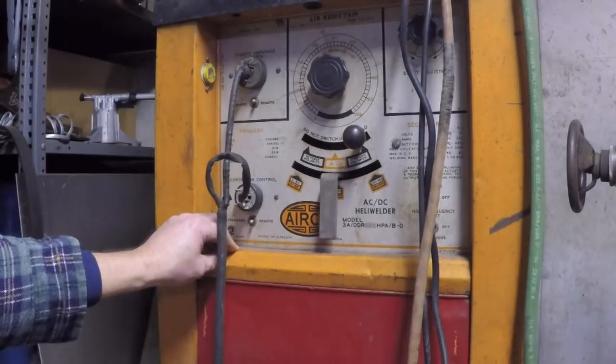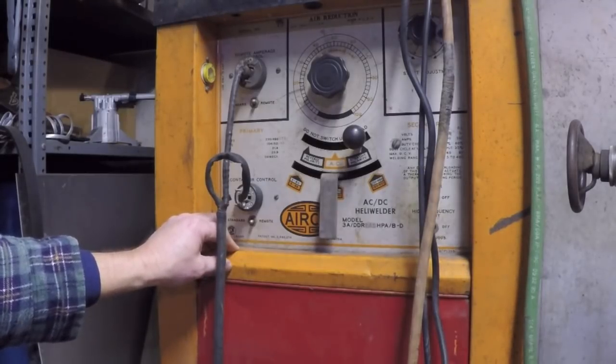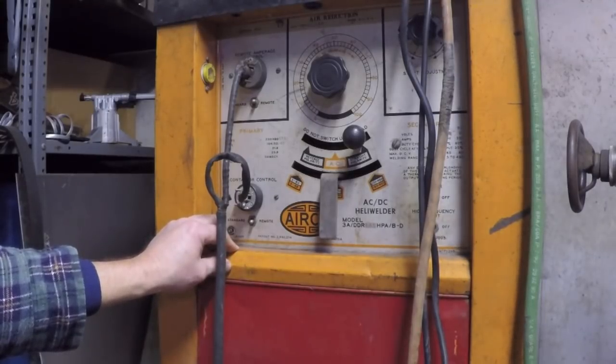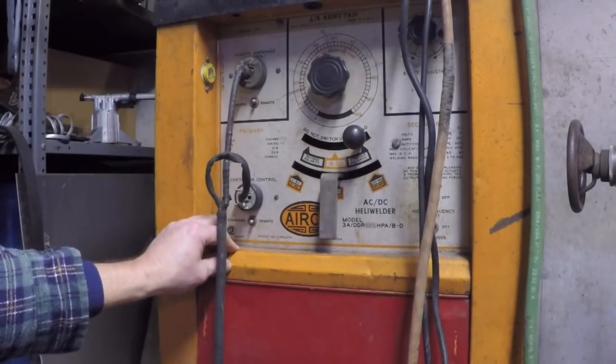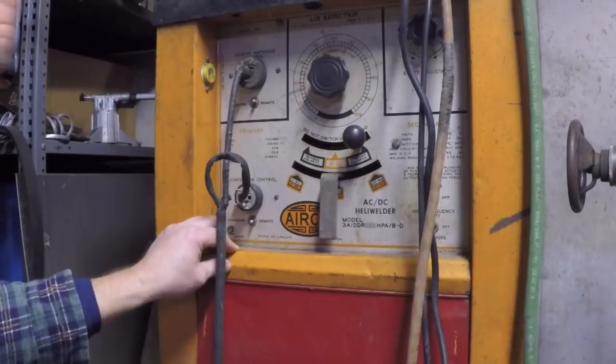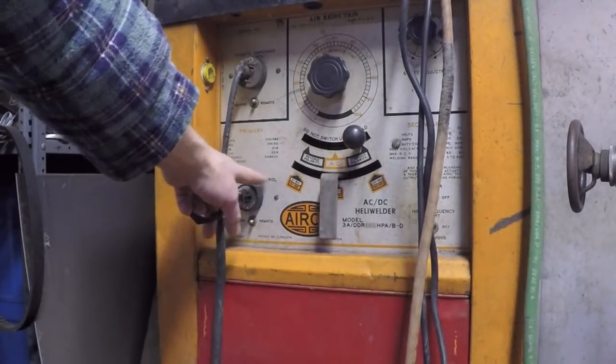Actually, even an audio amplifier, your typical stereo. What's happening in the output section of a stereo amplifier is you've got larger output semiconductors, and the waveform coming out of the output is being controlled by a much smaller waveform applied to, typically if it's transistor output, the base of the transistors. And you know, I'm getting way off the subject. This one, you can see it says contactor control.